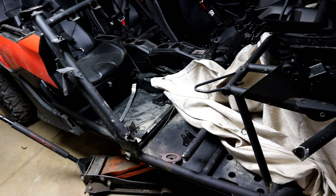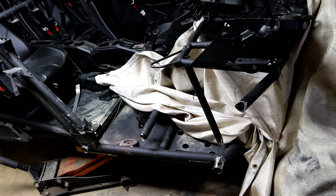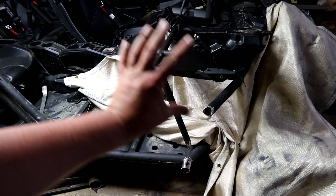Realistically, I am winging it, as I always do. Not a whole lot of people do any frame repairs on this, and I'm sure there's a reason for it. One school of thought would be to put everything exactly where it was supposed to be. There are two trains of thought — one would be like we did with the Subaru, where we X-framed it so we couldn't move and didn't lose where we were. Normally you'd do that, except that it's all been moved due to an accident. So I'm going to go to the old frame across the street in the trailer and take all my measurements so I know where these parts are roughly supposed to be. It's not going to be perfect — this is a temporary frame. One day I will put a different frame underneath this machine, but that day isn't coming anytime soon. This will get us close, and these frames get tweaked, so I'm pretty sure it won't tweak where everything we just did.